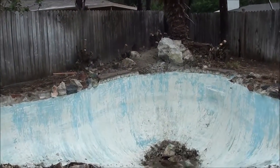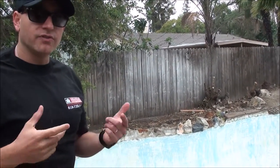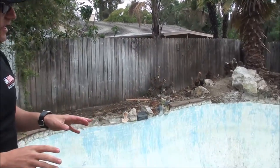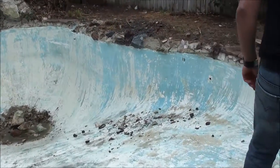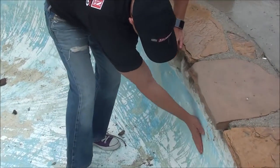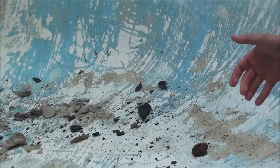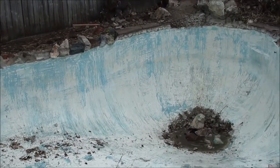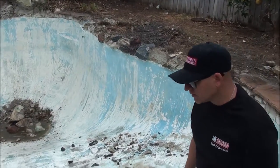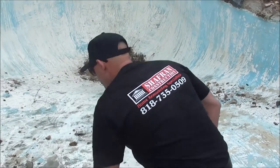Clients have asked us for a recommendation for the pool. You can always replaster. Re-plastering in our county probably costs about $7,000 to $10,000 depending on the application and finish. The way to replaster is to basically break away and chip away all of the old plaster. We took a pressure washer with very high intensity just to clear out all the peeling paint, and we believe that the plaster at this point is in pretty good condition. Therefore, we can refinish it with a priming method and we're going to use a very thick epoxy-based material to cover the surface of the pool.